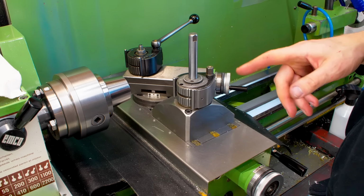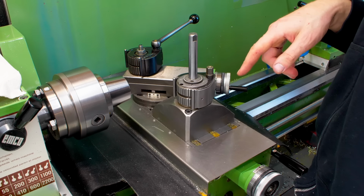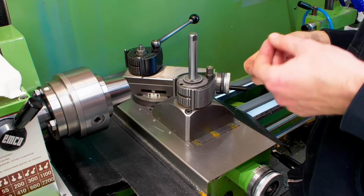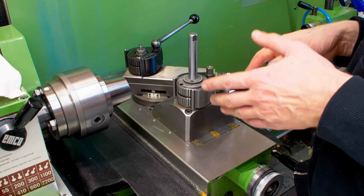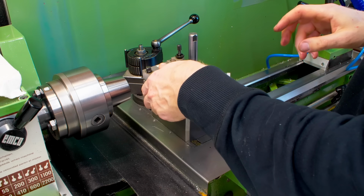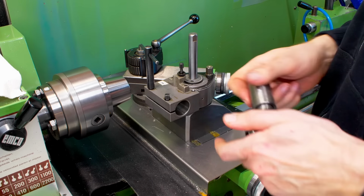I'm not a big fan of grinding on the lathe, especially for OD grinding. If the material can be cut with carbide or CBN, usually that's the better choice. Grinding on a lathe is only interesting if you're machining material that's extremely tough to cut by regular cutting tools or impossible. You can machine carbide. I have shown cutting carbide, but that was an OD and it's sketchy at best. This is a case where grinding makes sense because we are working an ID of a part in carbide with a small diameter. That's a very problematic situation that we can solve best by ID grinding.